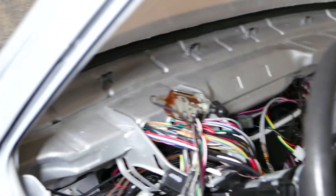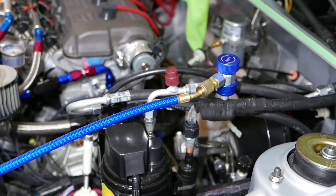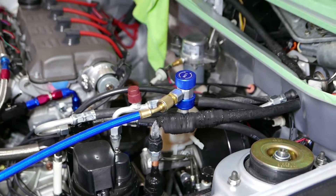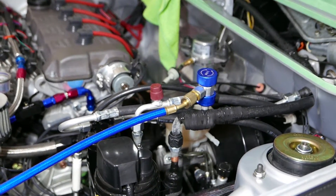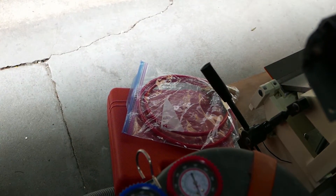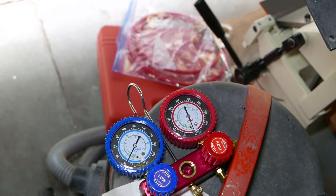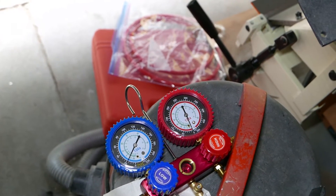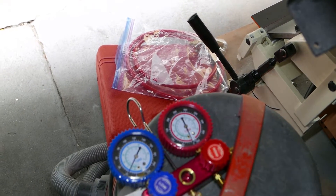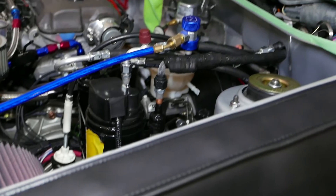The whole system is functioning correctly. I probably have a bit too much oil in the system — it's hard to judge. I can bleed some of the oil out by flushing refrigerant through it. I probably also have a little too much refrigerant in the system. On the low side I'm sitting around 17–18 PSI when it's on high, and it's wobbling around a little, which indicates too much refrigerant or too much oil. I am getting 60 PSI when I turn the system off and it's cold. It held pressure all night, which is awesome, but I've killed my battery so I've got to turn this off.